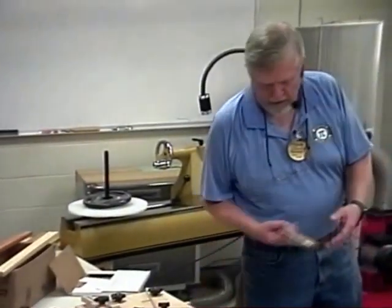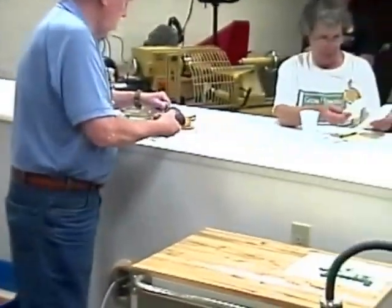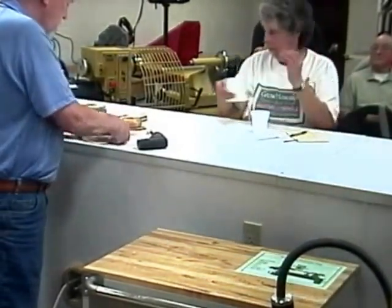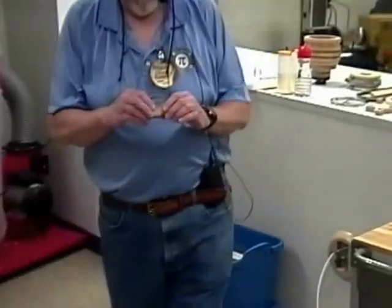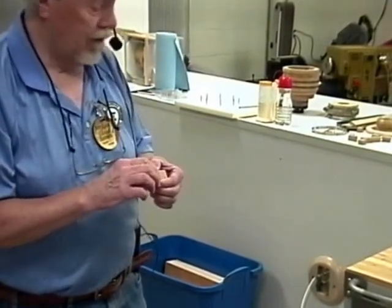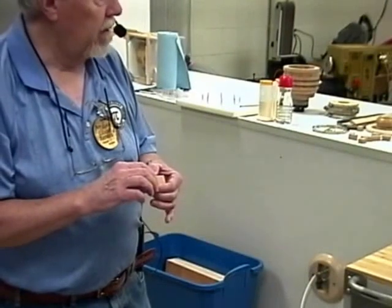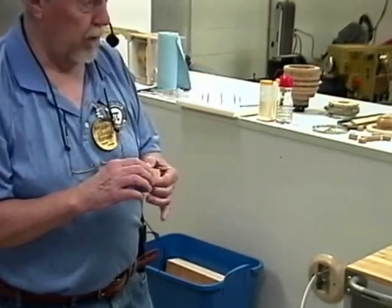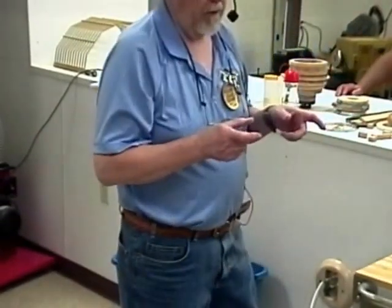You take a ring, apply glue to two mating surfaces and rub them together on a flat surface, and this works. It works really well. Especially with Titebond Original, it only takes a few seconds for that glue to start to tack. And once it has started to tack, if you don't abuse the little glue-up that you've done, it'll hold together for you in perpetuity. You do a bunch of those, and once you've got a bunch of little two-segment pieces assembled, then you start putting them together.